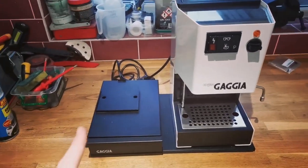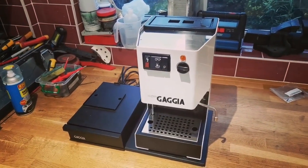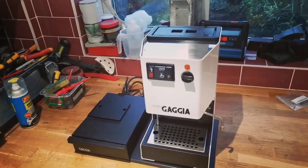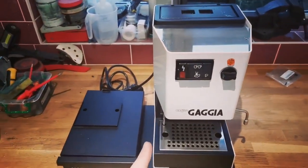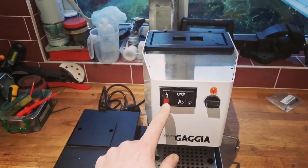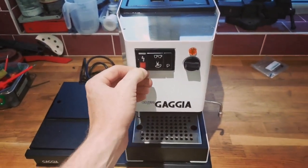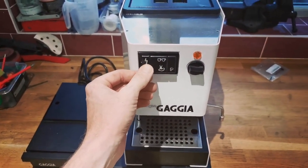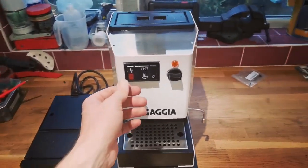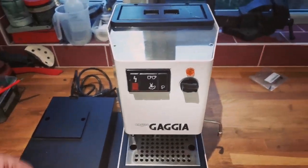Oh, it's painful. The grinder is actually in the kitchen because I've been using it for the last week and a half anyway. I cleaned that and got that working. You could also see that on my channel. Like lots of Gaggia coffees, the neon in there didn't work. So I took the switch apart, expecting to have to replace it, but the solder had just come off. So resoldered one of the legs on. Tested that, and that's all working again now.